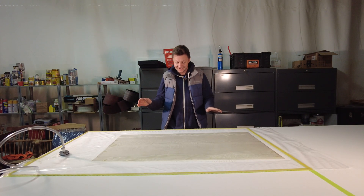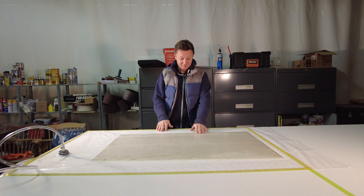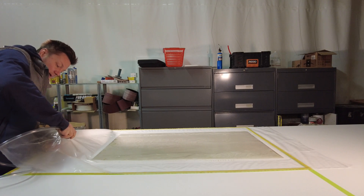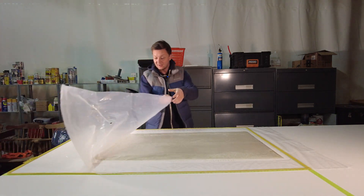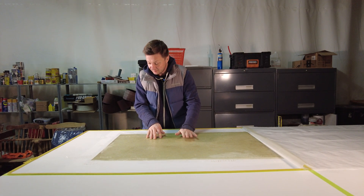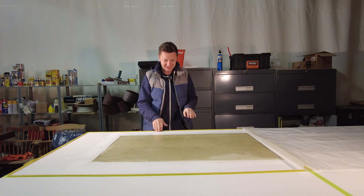It's a new day. Looks like everything set. Obviously I lost the vacuum because I was using an incorrect film bag — a plastic bag. But let's see what we got here. Let's remove the vacuum line so it's out of the way. And the drum roll... Okay, the back came out perfectly. Because we lost the vacuum, we have all these little waves on the backside, but I don't really care about the backside. Right now the question is: will I be able to lift the entire panel from the melamine sheet?